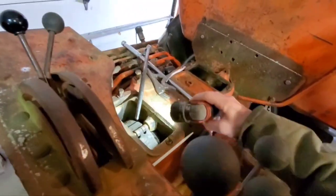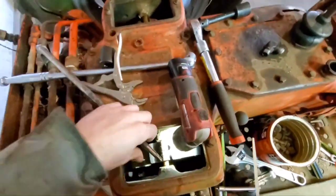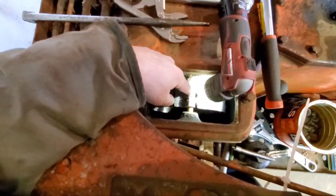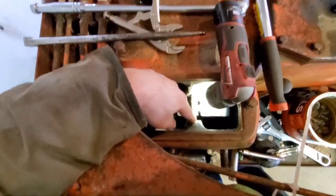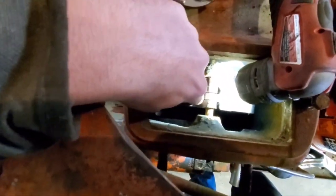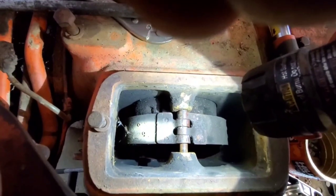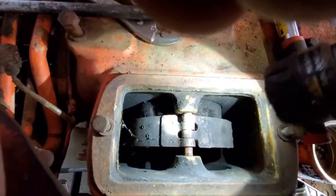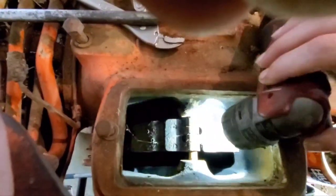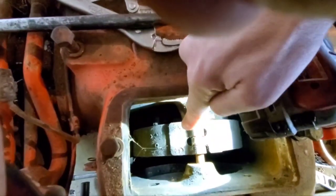We'll talk about a couple of things if I were taking this apart. A lot of times these pins won't come out. They get stuck in there. What I ended up doing on this side was I cut the brake pads here off with the die grinder. And then we were able to get a big set of vice grips in there and turn that and finagle it out then. Now, if it's really stuck, you could also cut a couple inches of this out.